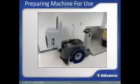The battery charger cord plugged into the wall, the recovery tank cleaned out and left open to dry and tipped out, exposing the batteries. The brush is clean and either connected to the machine already or close by and ready to use. The squeegee should be either connected to the machine or in its storage location hanging on the back of the machine.